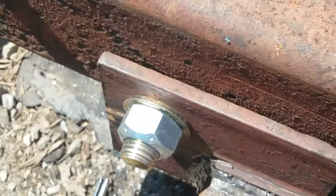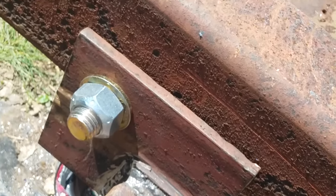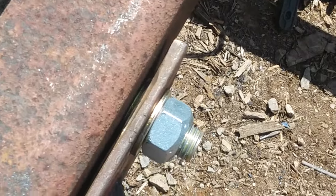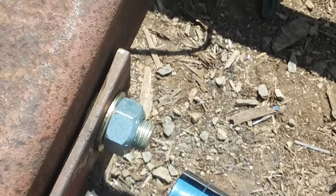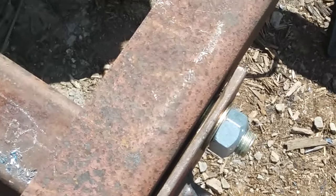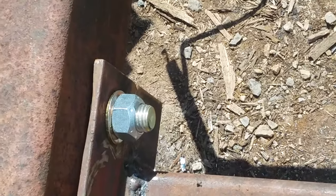Bolts are in and tight. What I did was tighten them down - you can see that spacer in there - tightened enough they're in and won't move, but they just spin a bit on their own. These are lock nuts so they're never gonna walk out on their own. If I leave the bolt a little loose, I don't have the friction in there on both sides - you could just drop some oil down there. I was thinking about drilling them and putting grease nipples in and cross drilling them, but that's further work and I don't think it's necessary for what I'm doing with this trailer. Big one-inch bolts with inch-and-a-half heads - they'll outlast me most likely.